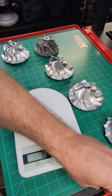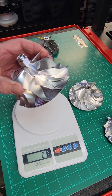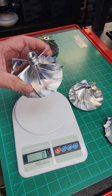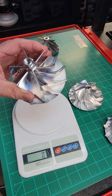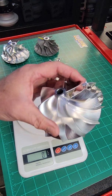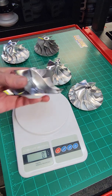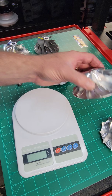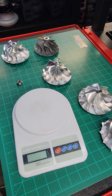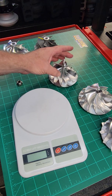The main reason you'll see a lot of flank milled wheels is machine time. Running this through simulation on Mastercam, we generally see mill times that exceed double when going from flank to our basic point milled. If we have four hours of machine time in flank, we'll have eight hours in point. Our really nice forged point milled wheels can jump up into 10-hour cycle times. Cost — obviously this time is money and machine running is money — so the flank milled wheel is going to be your most cost-effective upgrade.